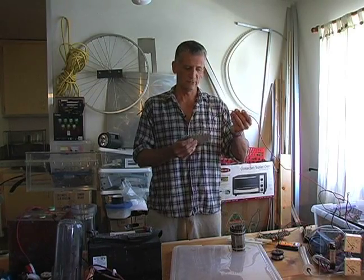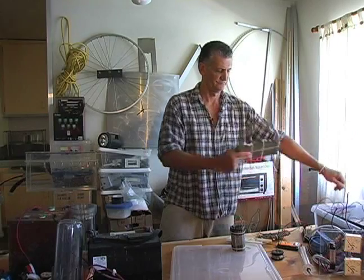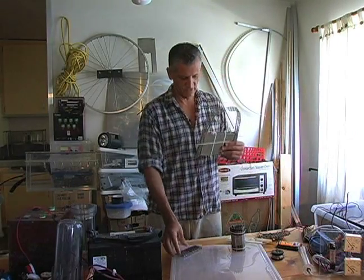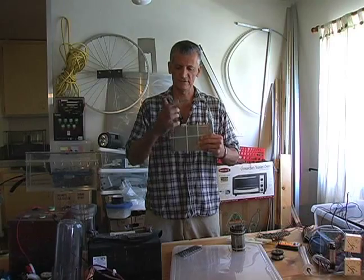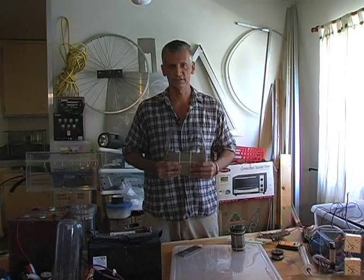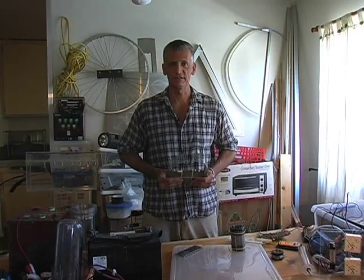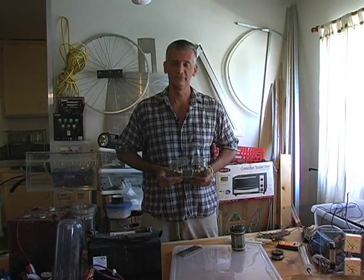Why don't you use stainless all the way up? Well, I did use stainless all the way up on this big one. But as you scientists know, stainless is a resistor. So I had resistance through these bars, which was killing my efficiency. In the next step, I'll show you how we assembled our little plates and what we did to improve our efficiency.